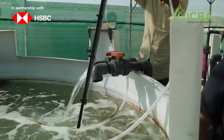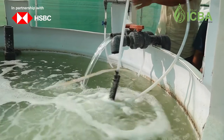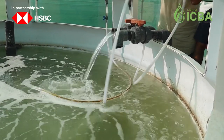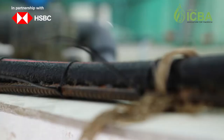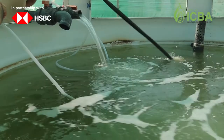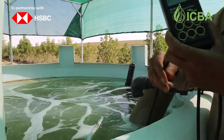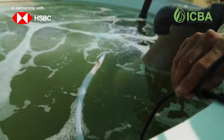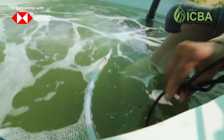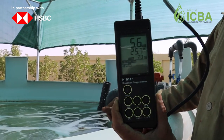Necessary oxygenation of aquaculture water can be done by air blowers or injection of pure oxygen. In both cases, the feed system is based on a grid that delivers fine bubbles through diffusers. On a daily basis, it is necessary to measure oxygen automatically or manually with an oxygen meter, and maintain oxygen levels in the culture tanks above 4.5 milligrams per liter.